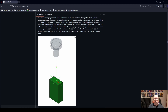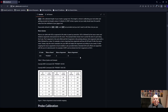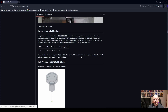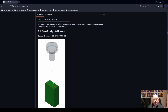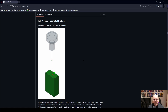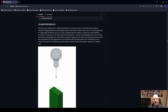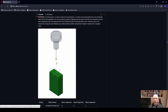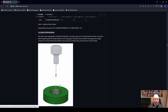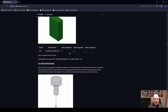Let's jump into the macros. I'm scrolling through the documentation to show you the magnitude of what's available. It shows you how to set up and calibrate your probe. Starting with calibration routines, you have the ability to calibrate your probe in Z using a 1-2-3 block, and you can calibrate the diameter of your probe using a 1-2-3 block or a ring gauge.